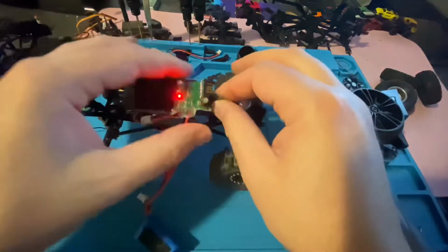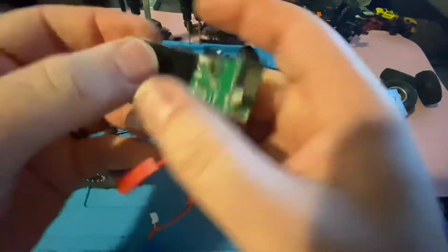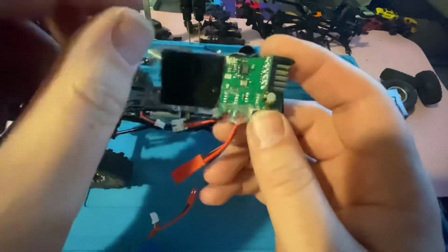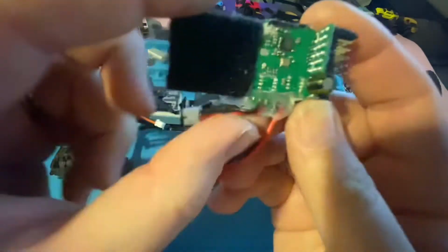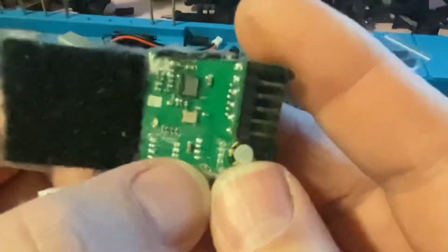And again, on this particular one, I went ahead and removed both chips since, you know, this is the first one. I just want to make sure everything was clean, nothing was burnt up. This chip looked like it had a little bit of swelling in it or bubbling up or damage to the chip. So I pulled out both chips. You make sure that none of the solder is touching where you end up cutting the chip out. Sorry, it's not focusing very well, but you get my point. So just make sure it's clean.